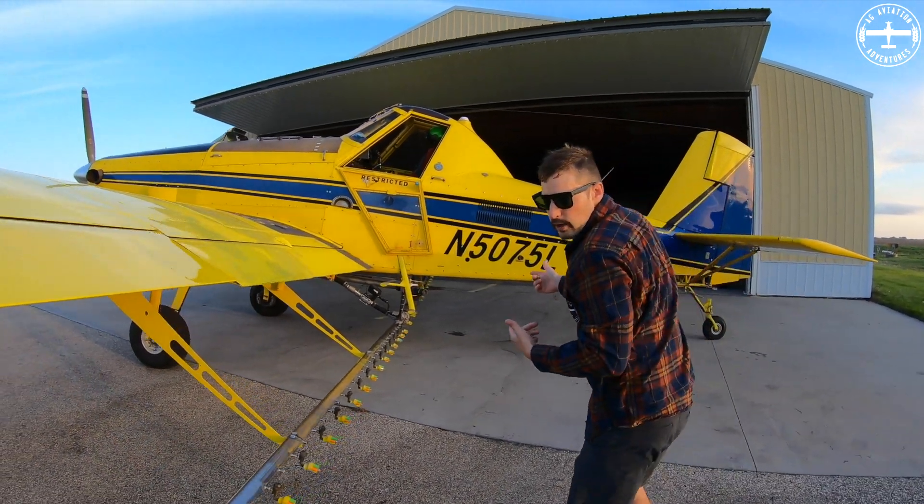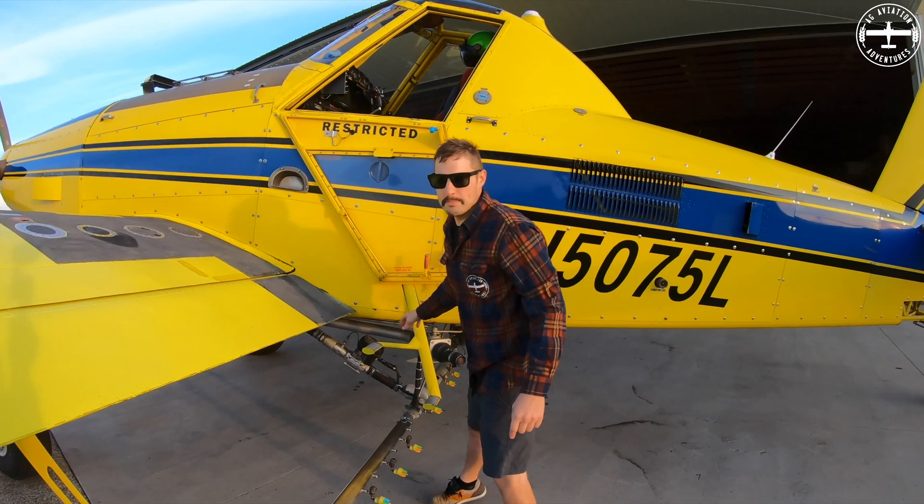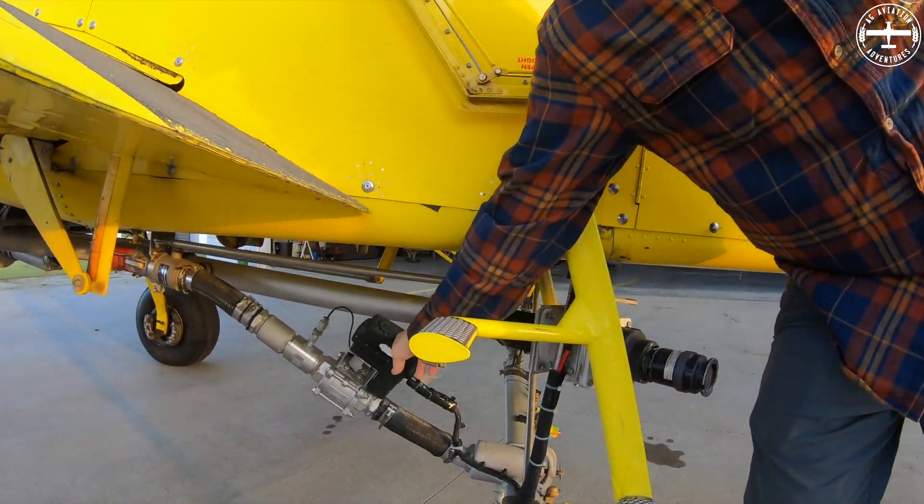If we go back over here you can see this box right here — that is what's called my flow control. I've spoken about it in a couple videos: if I'm going faster in one direction versus the other because of a tailwind and headwind, I don't want to put out the same amount of product at two different air speeds because that would not give an even application across the field. With the flow control and the GPS it knows exactly what your ground speed is, so it actually adjusts how much chemical is coming out of the airplane based on my speed and what I've physically entered into the GPS for target output — so everything is evenly applied.